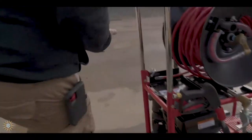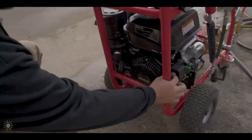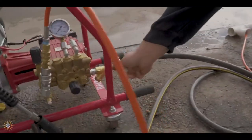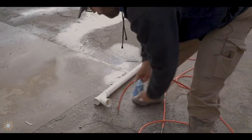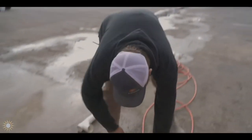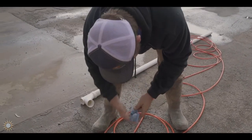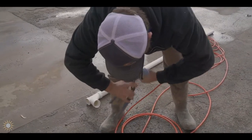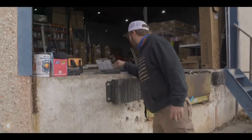Before doing anything, throttle the machine back down to idle. Now we're shutting the machine off - turn your key and the machine is off. We still have water running, so come over and turn your ball valve off. Water's off, levels are at zero, everything looks good. Next, pull the hose out of the drain and retrieve your tip. Sometimes you need channel locks to get it back off because it tightens itself down - use smooth-toothed channel locks and put something around the tip so you're not messing it up. Make sure you put your tips back where you found them; these are easy to lose. Set it back in the box - don't put it in your pocket or anywhere else.